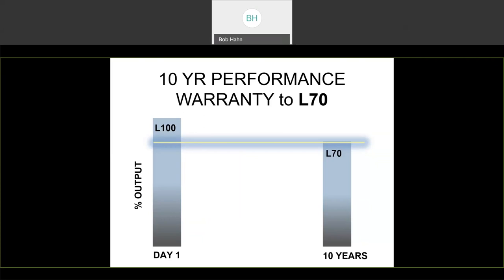An exercise we just completed: we actually removed a wall pack from the back of LUMICON which had been lit and running for ten and a half years. We had the original IES files from that product and sent it out to have another LM79 report done on it. Using a Cree XRC LED — one of the forerunners of almost all high-powered LEDs, now a 12-year-old LED — we had about a 28% drop in light output running at 365 for ten and a half years. Proof is in the pudding that we stand behind our products and our conservative designs to make sure we're giving ten years of useful light output.